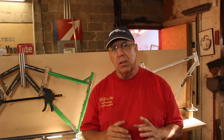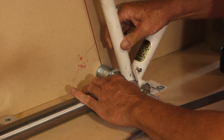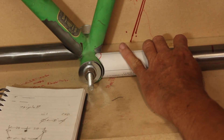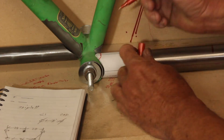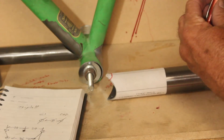Once I get these last two tubes cut and fitted, all I'll have to do is prep the actual weld surfaces by making sure all the paint is gone and washing with acetone. Then we'll bring in the welder and weld it all together. Look at that fit — that is beautiful. We had an intersection with the seat tube so I just kind of free-handed that in. Now we have a similar situation over here. I've butted this tube up against the bottom bracket and marked where the seat tube is, then came in with a piece of tubing and marked the curvature. Now I'm going to grind that out and fit it together manually.